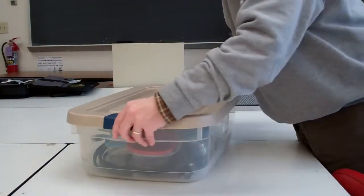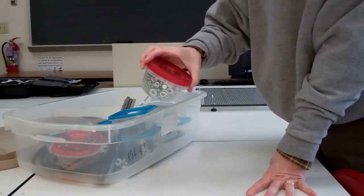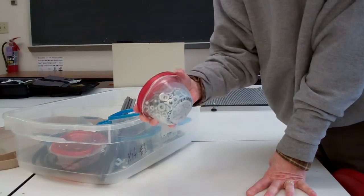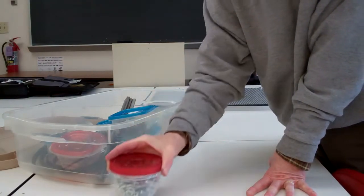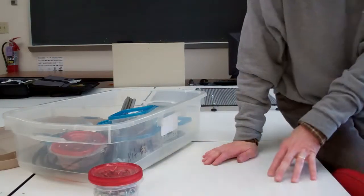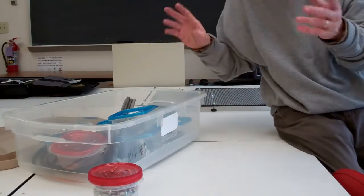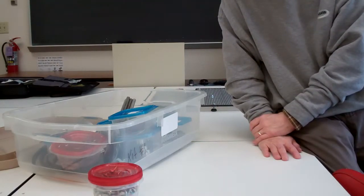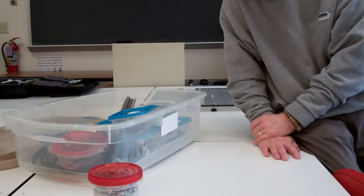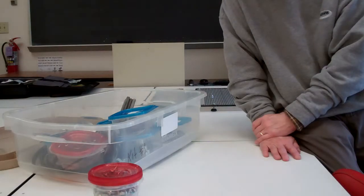In your kit you'll have a container with lots of screws, washers, nuts, lock washers, and even some wing nuts to make hand-tightening easier. When assembling components, initially don't tighten much at all — when you're happy with your alignment, then you can tighten. Just be careful not to over-tighten, because we're not operating under high-speed, high-stress conditions. If you normally over-tighten things, ease back a little bit.